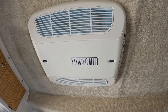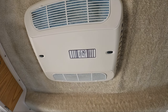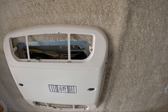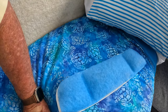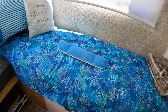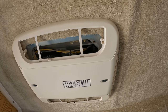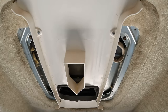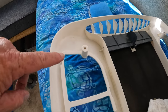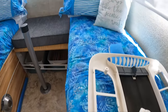Let's go inside now and do the inside. This is what our air conditioning unit looks like on the inside of our Casita. Yours may be different depending on the model, but you still have to take this cover off to be able to inspect the air conditioner. I've pulled the filters — we have upgraded filters and I'll put links in the description. They keep it cleaner inside and keep the unit cleaner. The two round holes on the end of each filter, both two on each side, have to be taken out to get the cover off. Screws are one on each corner of the unit and two under each filter.